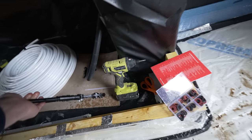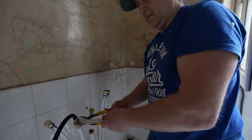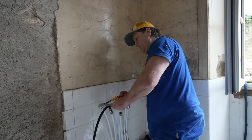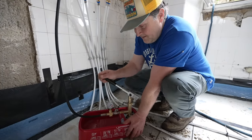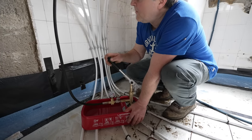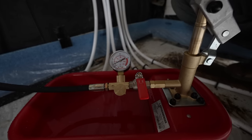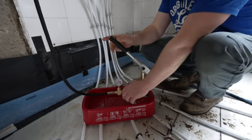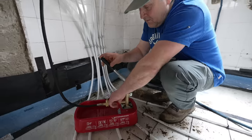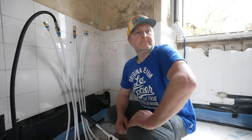We haven't flooded too much - let me just remove this. That's soaking wet! It doesn't have to be mega tight because it's got a huge rubber washer - this one has to be relatively tight until it stops. Ready Sean? Take off - go on mate, there we go, slowly does it. A little bit more. Now if we turn it off we can keep an eye on the pressure gauge. Pump it up to five bar - open the valve. Okay, close the valve mate - we're about six bar, it's holding good.